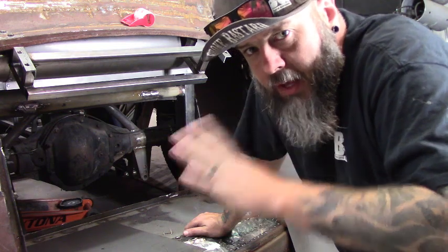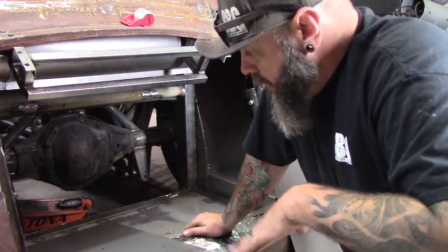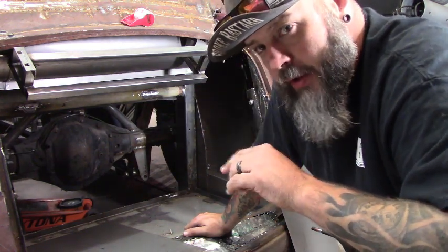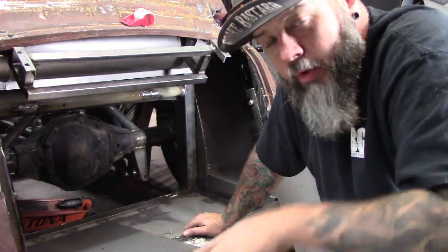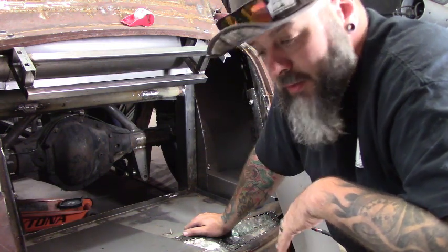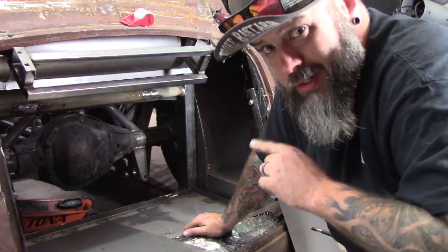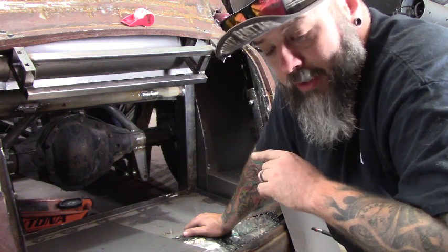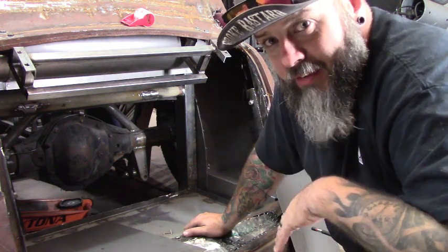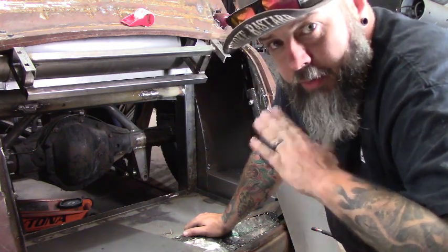I made that big piece with the bead rolling and put it in, but I just didn't like it. So I've decided to make this piece out of three pieces instead — that way it has rivets all around it, and the center piece will have flanges that lay in on either side, then it'll all be riveted together. I think it's going to look a lot better. It's interesting putting this on because I'm drilling into quarter-inch steel, so I have to hand-drill these. I punched all the sheet metal first, but I only have about six rivets left, so tomorrow I'll go get more and then finish it up, but I'll put a couple rivets in now to hold it in place.